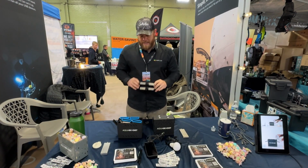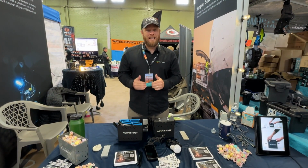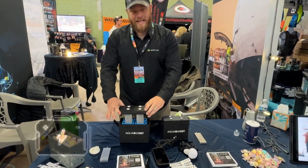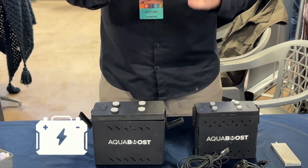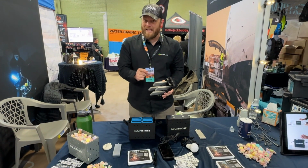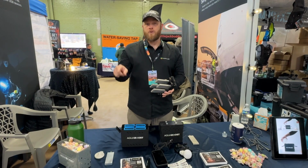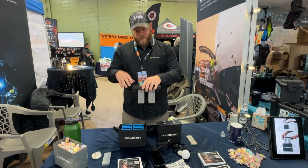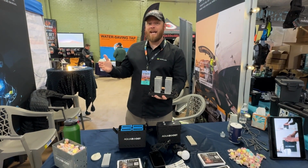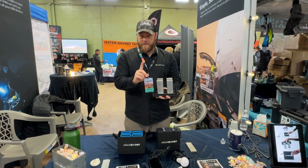What's really nice about this is that you can turn the fuel cell on and off by just simply removing the lid. When the metal comes into the lid like this, it activates the fuel cell because now the salt and the metal are touching and they're reacting. But as soon as you remove the lid, it deactivates the fuel cell, which means when you pour in salt water and you have a 12-hour power life, you can use those 12 hours whenever you want. You can use them for 2 hours now to charge your phone when it's at 100%, take your lid off. Then you can use the 10 hours later tonight, tomorrow, next week, whenever you want. 12 hours of power with 1 fill of salt water.